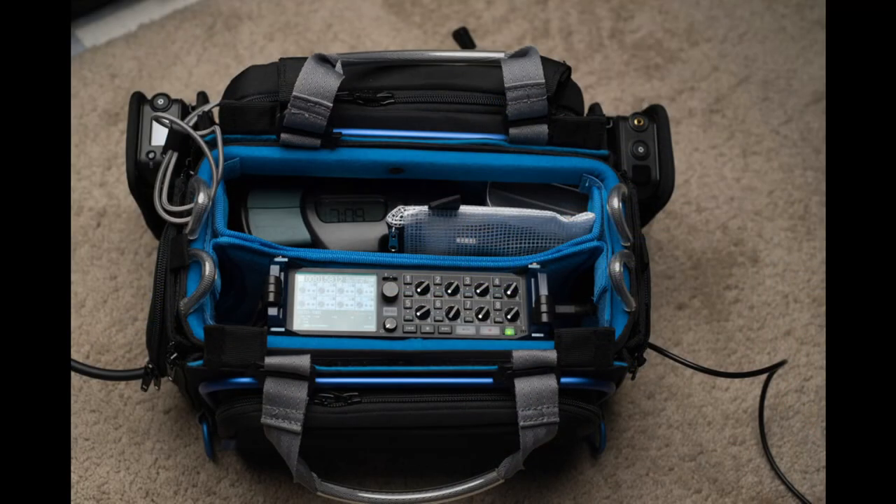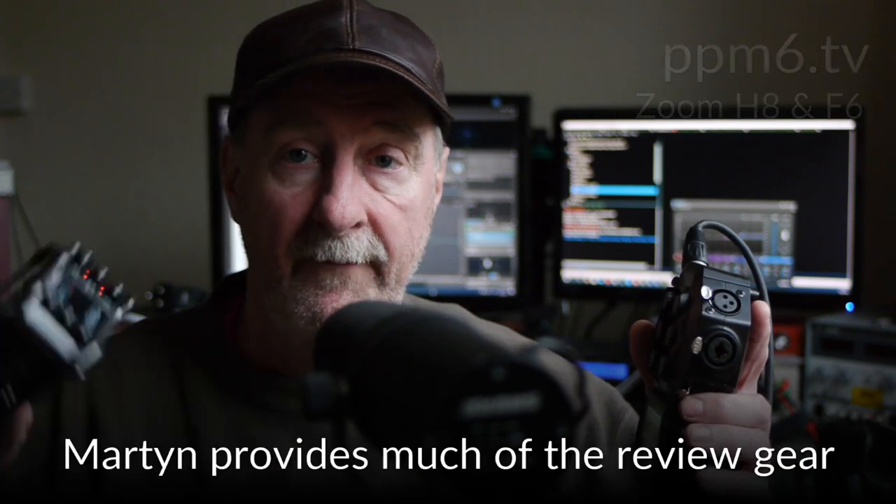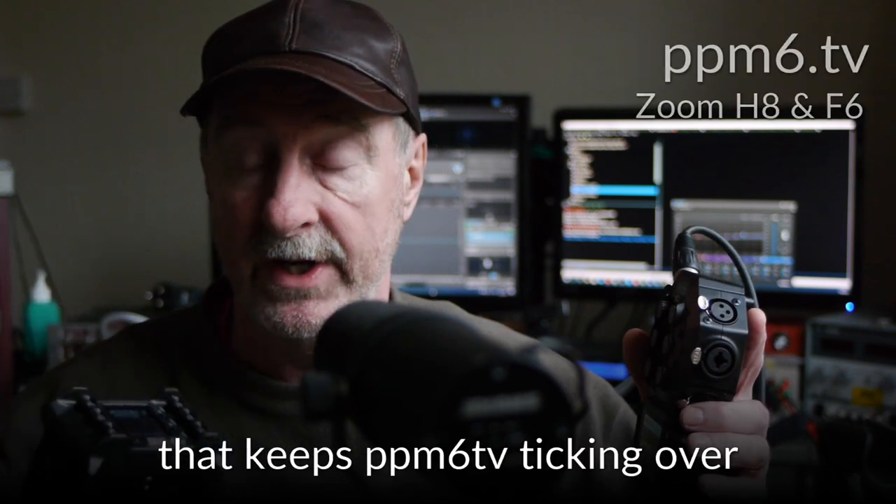I'm not saying they aren't used in the field — there are millions of H series recorders in use in the field, of course there are — but I'm going to tell you why I don't think it is for me. When you boot this thing, it's got a nice little touch screen. You can see I'm recording; it comes up with some apps and you can choose which mode to work in: podcast, music, or field. Zoom obviously think this is a field recorder, but I'm going to disagree. For me, a proper field recorder goes in a bag around your neck to leave your hands free. You can mount this on a threaded insert on the back, but an F8N, F8, or F4 is designed to go in a bag with all the important controls on the front face.